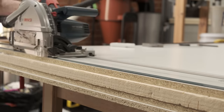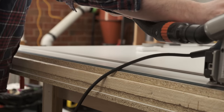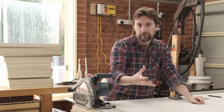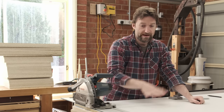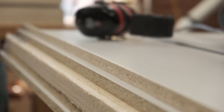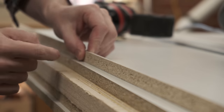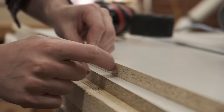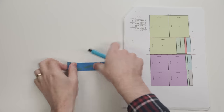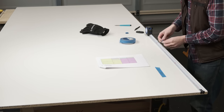When it comes time to taking these rough blocks down into the final dimensions at the table saw, first I will rip off whatever the garbage edges are and then cut to the actual dimensions. My cut lists are all based on the size that I want - 2.4 by 1.2 - so I'm not accounting for having that little bit extra, which means I have that little bit extra to actually cut off. This is the cut surface, this is the factory edge - it's much rougher. As I'm rough breaking down the sheets, I label each section with the sheet number and section letter. Cut lines marked on blue tape stop them wiping off easily like they do directly on melamine.